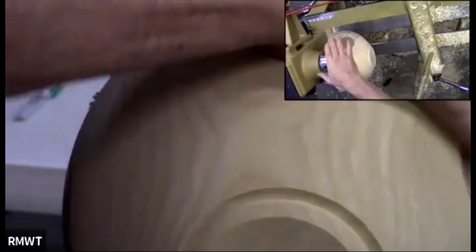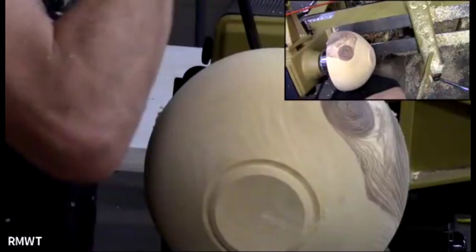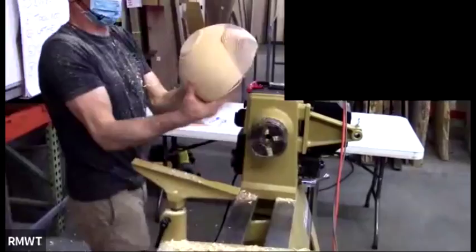I'm a little stuck. I'll pass this one round. But the main thing is, you'll feel tool marks, and I got a couple here, more than I'd like, but hey, I have no torn grain. That's the important thing, because tool marks come out with a tiny bit of sanding, but torn grain does not come out, because you've got to sand below the whole surface.